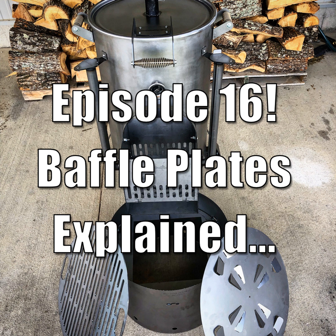Now that air only has one path — in order for it to go up, it has to go through the charcoal basket. I've done something similar in Luan, for instance — it's a huge firebox, four foot by four foot footprint. For the air coming in at the front door, it could go anywhere inside that firebox without direction. So we put a series of baffles in a square pattern around the outside perimeter of the firebox and placed the log rack dead center in the middle of that baffle system — blocking off all the free area so all the air has to go through the coal bed. That's controlling the combustion air path using baffles or air diverters.